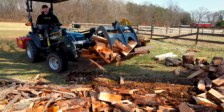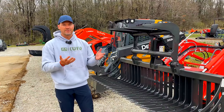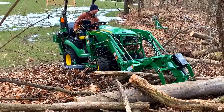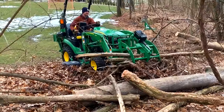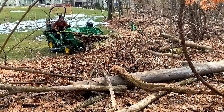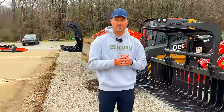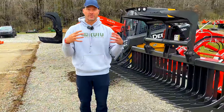We keep talking about having to add hydraulics — that is an extra cost. But if you don't want to mess with hydraulics at all, WorkSaver offers an electric grapple for small tractors. You have to have a quick attach — JDQA or SSQA. It's great for John Deere 1025Rs and Kubota BXs, and one frame size up — John Deere 2025R, 2032R, Kubota LX, Kubota B series. Those kits include all the electric harnesses and everything you need; you can hook it up yourself in a couple of hours.